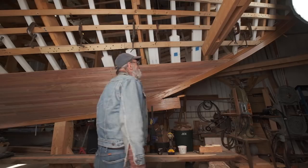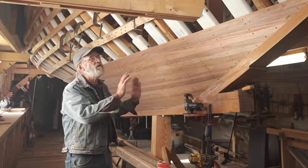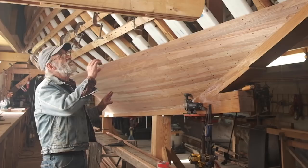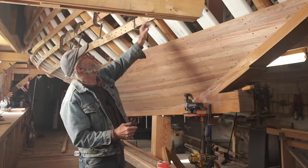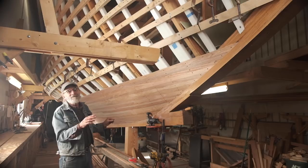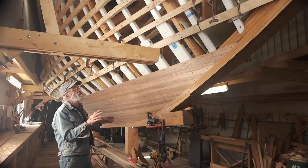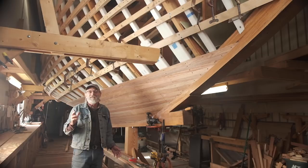I'm going to take this clamp off and rehang my clamp up above, and that removes the ribband. Like I said, we've got a lot more ribbands on this boat than you would normally see, but I think it's fantastic because it holds the frames really nice and fair. The ribbands are also fairly heavy. We wanted to make sure that if we could edge set the ribbands in place, then we could edge set the planking in place. The ribbands are two and a half inches wide — fairly heavy, especially these bottom ones right here.